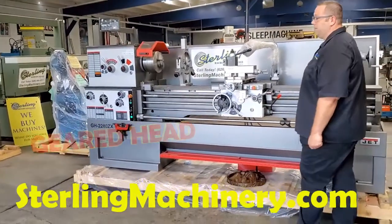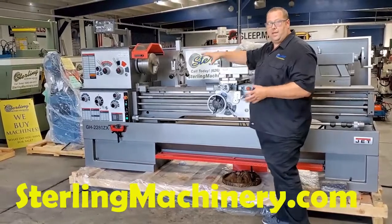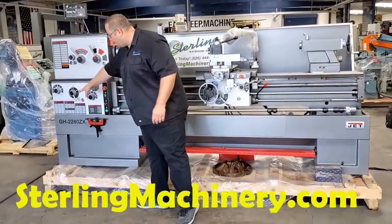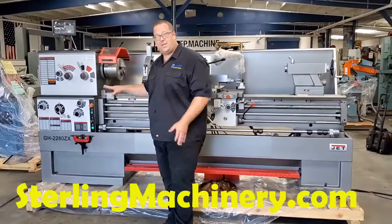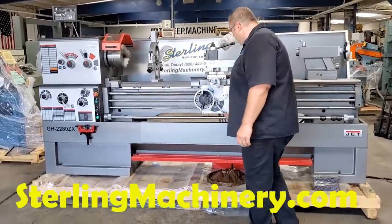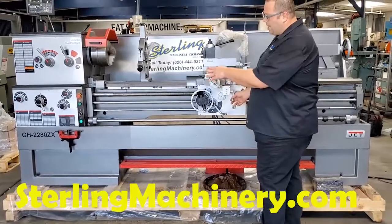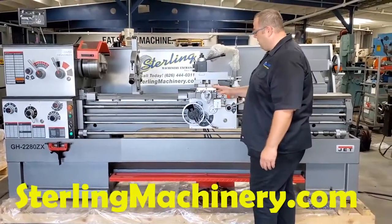Here's our second speed range. It's a geared head machine, so that's what you're going to be changing with all these handles and different gears. It's got a really nice, easy gearbox to find all the different feeds. There's a ton of different feeds — diametrical pitch, and metric. Everything's set up in that box to just change it around. We're engaged. Longitudinal feeding. We can change the speeds just by changing it over there. And here's our cross feeding.